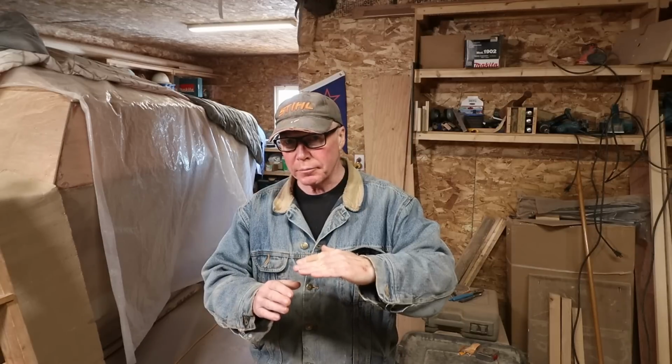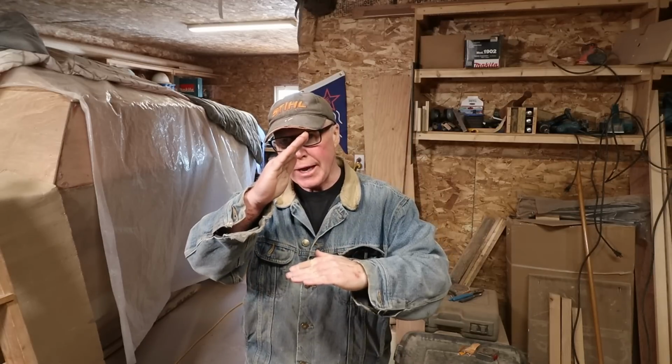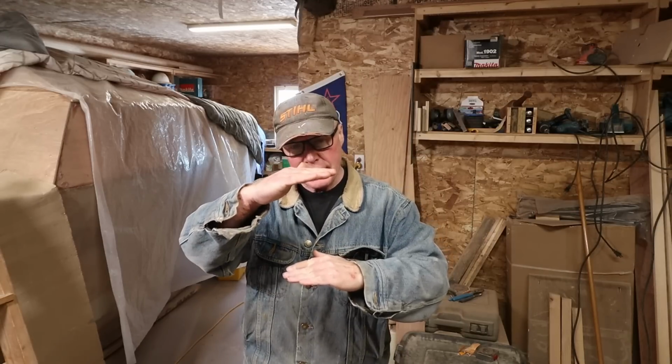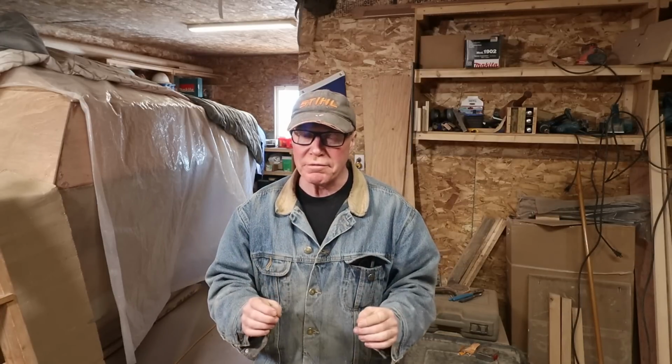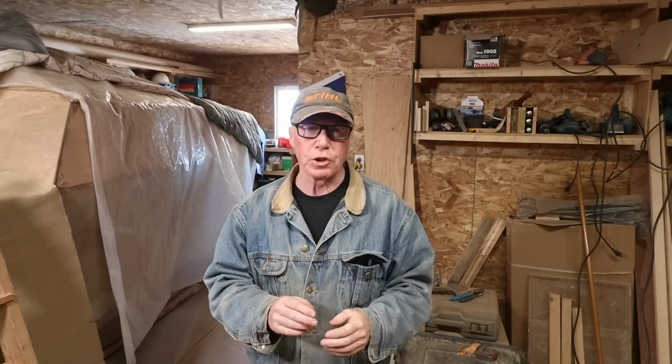So battens are the components inside the junk rig sail that are located between the boom at the bottom and the yard at the top of the sail. And they're the individual components that make the sail so easy to reef and keep the sail extended in all conditions. Now, you do have a couple of options here.